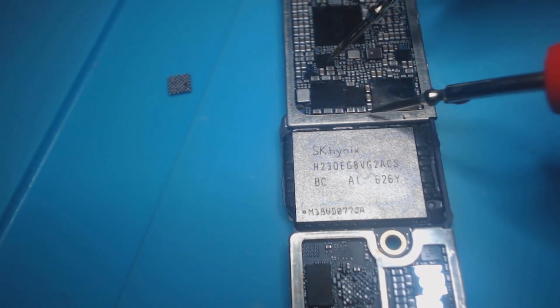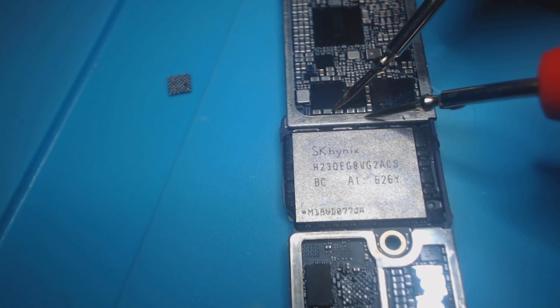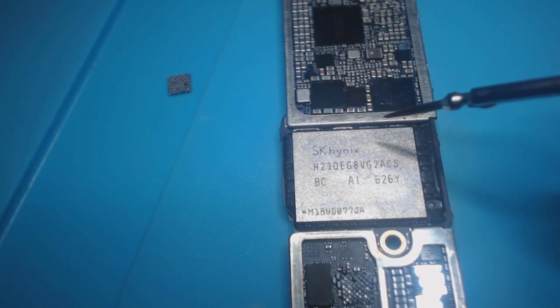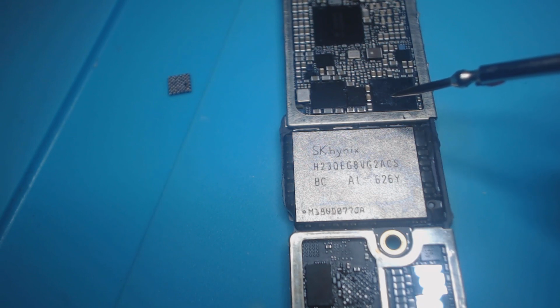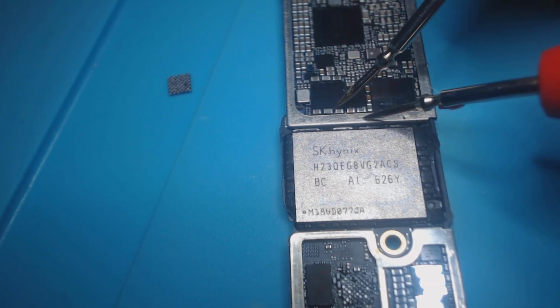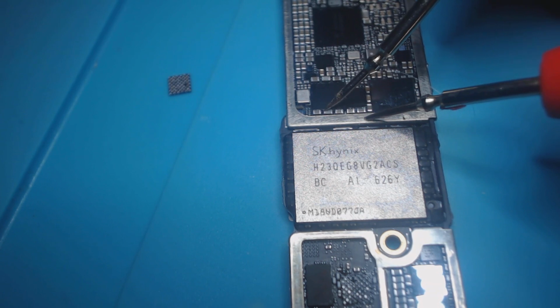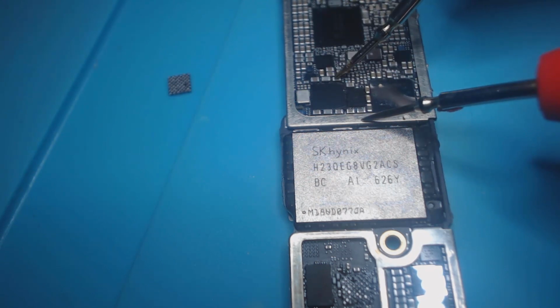Let's put it back. So the short's gone on LDO3 and on LDO9. Looking at ZXW, not the schematic, it doesn't look like they're related. Well, they're related somewhere in there. All right, take another reading. Zeros. I'm already up to 0.3. Same over here. It's increasing in the 0.3 range, and it'll go up.